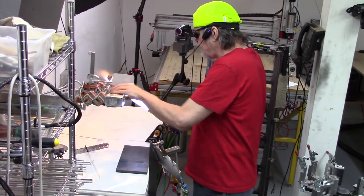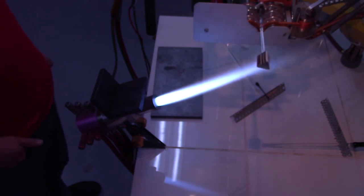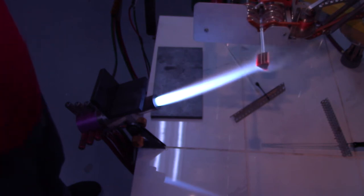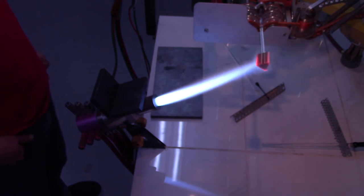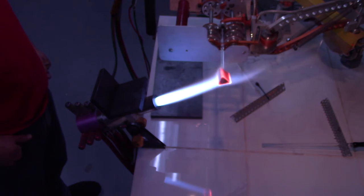Now this one is another one that, from the other end of the pole, definitely needs sizing. This one is not only bigger on the far end, but it's got a little bit of twist in it. Pulling a large, hot, triangular piece is pretty challenging, especially for someone at my skill level. I try to keep them straight. I try to keep them uniform. I try to avoid twist. But sometimes a tiny bit of twist just creeps in. And the resizing operation fixes that problem along with the problem of being bigger on one end.